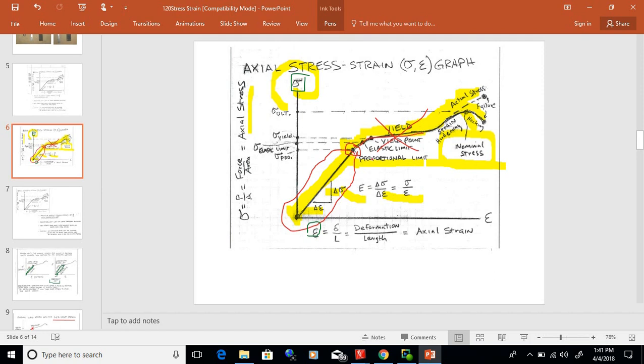And as a result, E will have a meaning here because E is the slope of that line, this modulus. Once you go beyond that point, E doesn't really mean anything anymore, because if you go beyond that proportional limit, what you're doing essentially is just saying the material's curve just keeps going straight up at that particular slope, and it doesn't. So you don't use E beyond that proportional limit. So we're careful under normal circumstances not to load materials beyond their proportional limit. And when we do that, we can use E in our calculations, which we very commonly do.